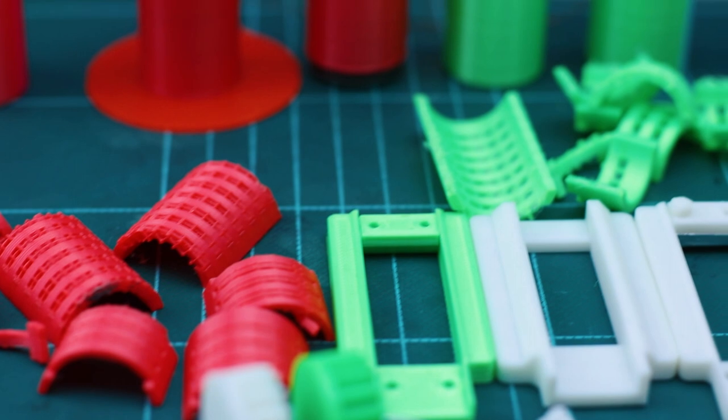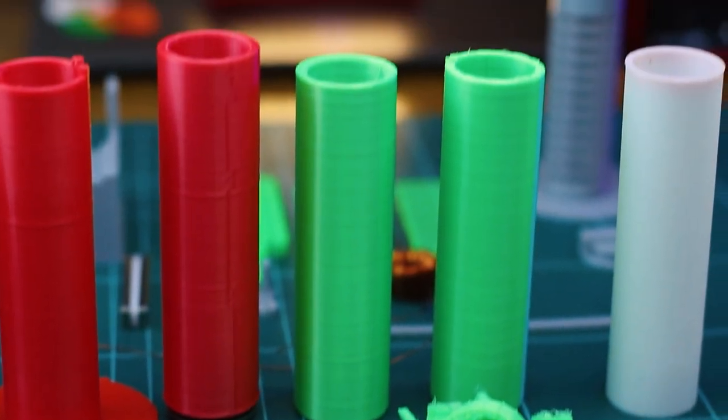Maybe printing with a conductive filament, although modified PLAs are often harder to work with than regular PLA. I tried printing with silk PLA a few times, but at any temperature I got very poor layer adhesion, especially in the small areas and layer changes.